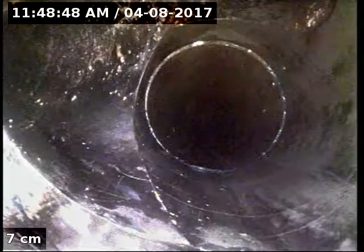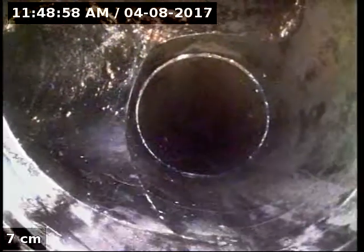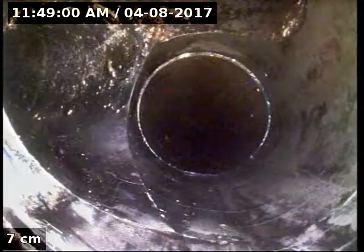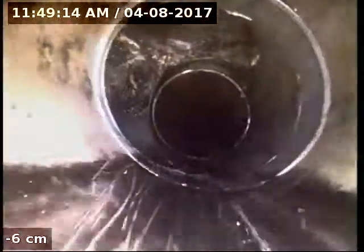This is a recording of 15 Magnolia Court, Innes Park. We're just back upstream from the greywater tank, sitting at the junction that picks up the grease trap from the kitchen sink. Coming back down here, we go around a 90-degree elbow — basically it's let go, which has created a big belly in the pipe, and it's sitting near on full of water.